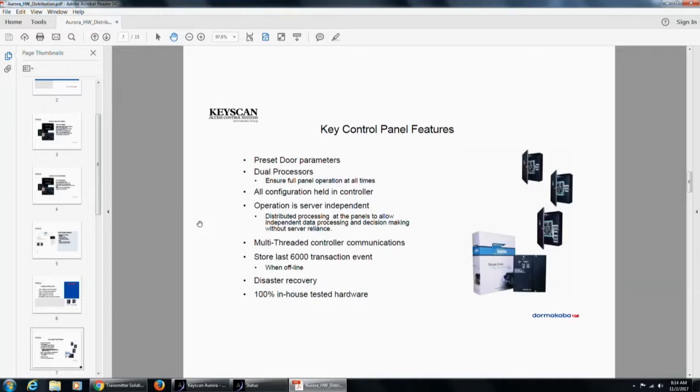I'll use a slide to explain that to you a little bit later on, but right now, you typically have 4 devices that go on a door. You'll have your reader, your lock, your request to exit device, and your door contact. If you've got all 4 devices on a door, you wire them back to, take door number 3 on an 8-reader control panel, and as long as you land your wires on reader number 3, request to exit number 3, door contact number 3, and lock output number 3, you'll have a fully functional door right out of the gate, ready for you to play with.